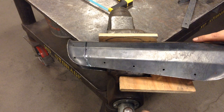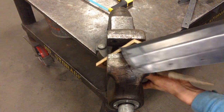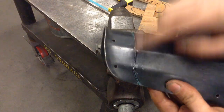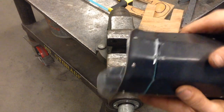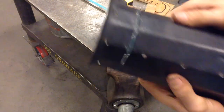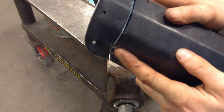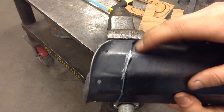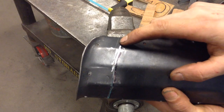We're mostly cut through to the point where the hacksaw is binding at two small points, here and here. We can finish out the cut with the hacksaw, but just know there's enough deflection to where the sheet metal is trying to grab the hacksaw. These little points at the edge are very hard to extract, but it's important to keep this clean so we can transfer over to the master template.